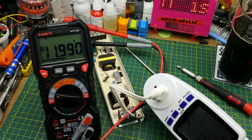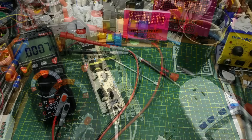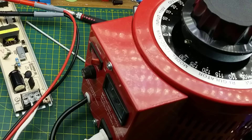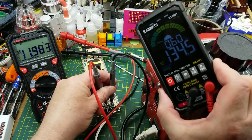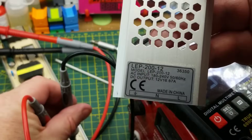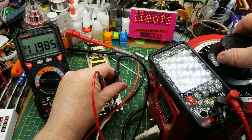Next test, I'm going to adjust the input voltage a little bit, for which we'll need the autotransformer. I'll add another meter to monitor input voltage — that's 135 volts right now. The unit claims to work up to 240 volts, so 135 shouldn't be a big deal. Let's see what happens when we start cranking down the input voltage.